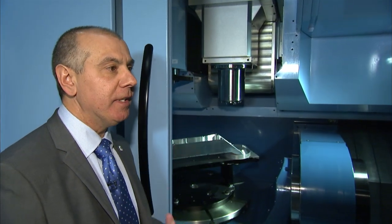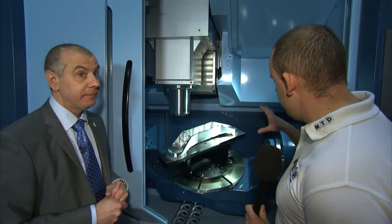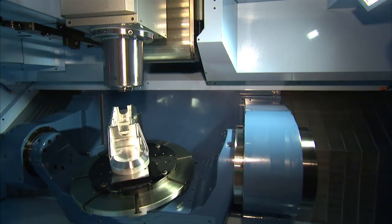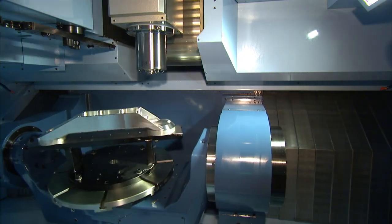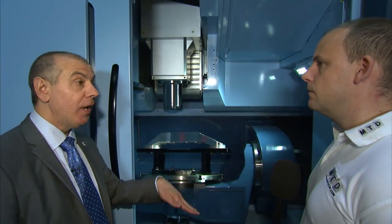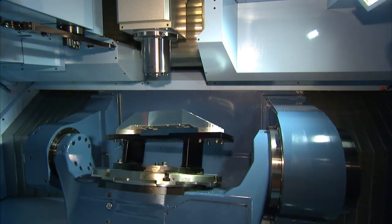Like all Matsuras, the brochure will always say one thing, but your actual capacity is always a bit more. With the table, you've got two options: you can have a 700mm or a 500mm — 500mm is standard, with 700mm as an option. On all our MX machines, if you have the smaller surface table, you can also have side tables, which give you either a very large 4-axis machine, 3-axis, or OP10, OP20, OP30 — so you can top and tail a 5-axis component all the way through in one hit.